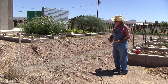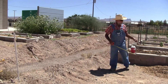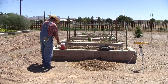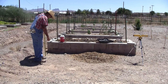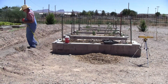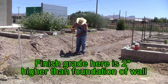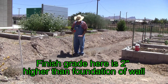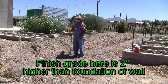To design this wall we've used this laser level here. Right here is finish grade, so right here we've got 32 inches where my feet are. We come down here and we've got 34 inches, meaning that the bottom of this trench is two inches lower. And you'll see that I have leveled it with pea gravel.